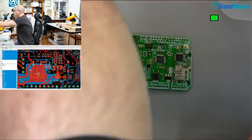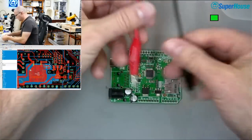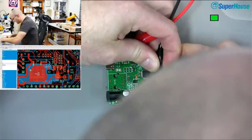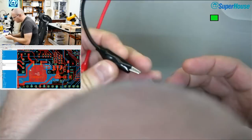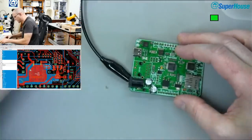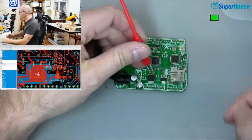And I need to set the power supply to 5 volts, so I'm not injecting 12 volts onto the 5 volt rail, which would be really, really bad. Not the ideal thing to do. Now, these alligator clips are quite large and horrible. Yeah, that'll do. All right, so what I'm going to do is just connect... Where will I do it? I'll find somewhere that I can connect ground. This one, that'll do. Ground can go on there. And then I'm just going to probe briefly anyway. This doesn't have to be particularly stable because I'm just going to touch this onto the input of the regulator.